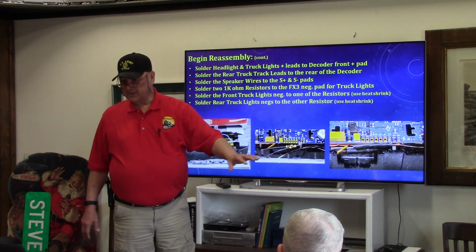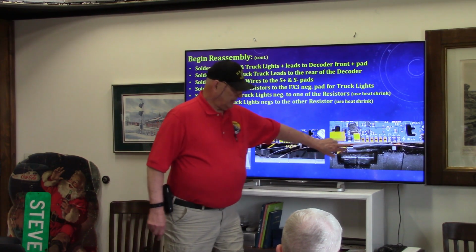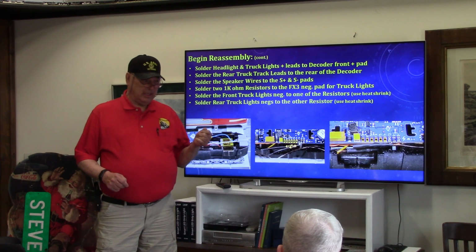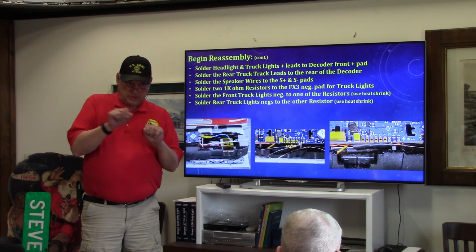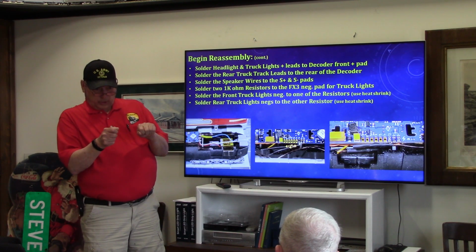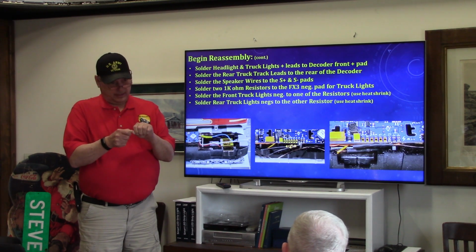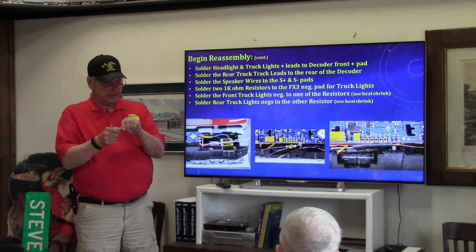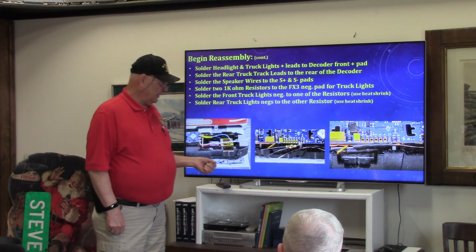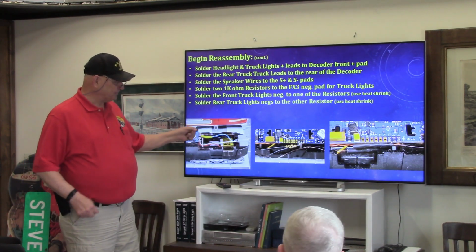Then I soldered them on, and I used heat shrink tubing to protect the resistors and the stripped part of the magnet wire. And the magnet wire, by the way, is coated with a lacquer type stuff. You don't have to strip it in the traditional sense. Basically put a blob of solder on your soldering iron and just run it through the end of it, and it'll literally melt away the lacquer insulation on there, so that you have a solderable tip, and it'll tin it while you're doing it. And all wires, of course, were tinned before I put them on the pads.